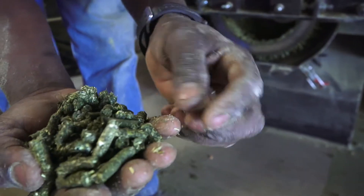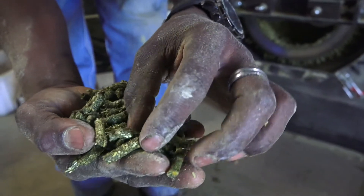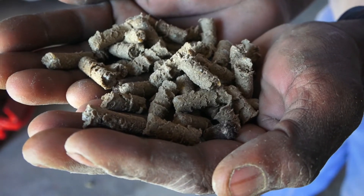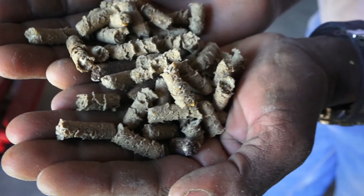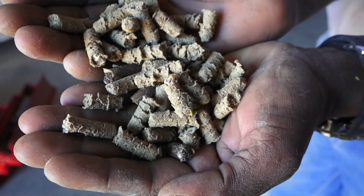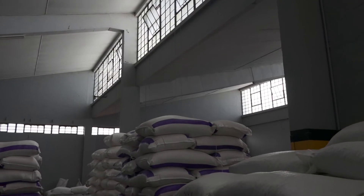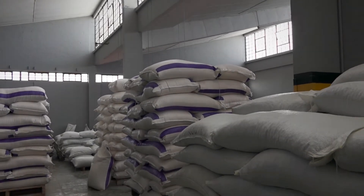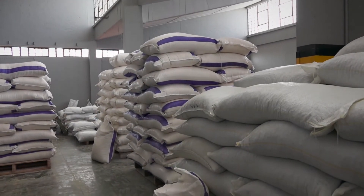The first indication that a mixture is too moist is the production of pellets that tend to bend to one side and have a scaled appearance where tiny pockets of steam have escaped in the high-pressure production process. In some cases, pellets produced with a mixture that is too moist will fail to cool off properly, leading to soft or moldy pellets when stored in bags.